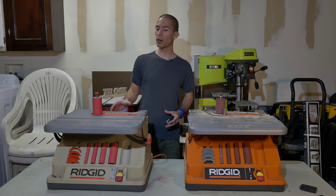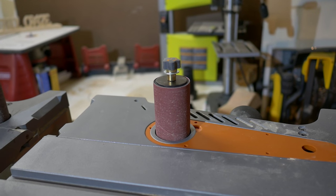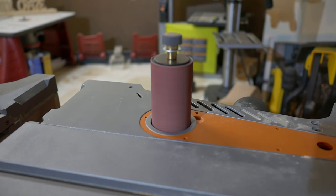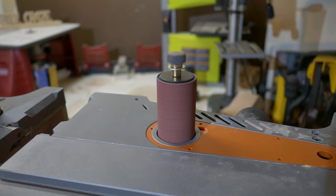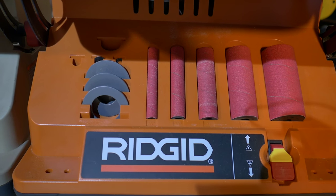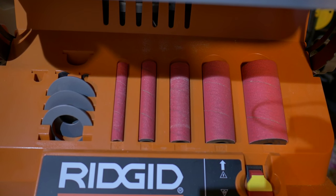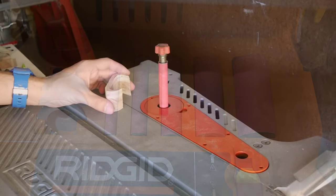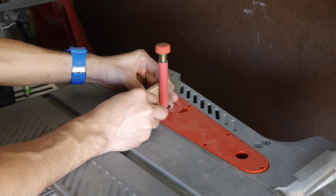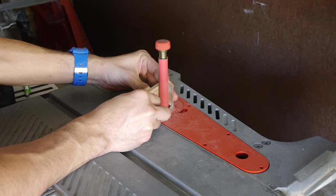One of the reasons I went with this particular model is because I was looking for an oscillating drum sander. What that is, is a sander that has a rotating drum and it moves up and down as it turns. The sanding drums are for sanding curves in your workpiece and can sand inside and outer curves. They come with several sized drums — five are included with this model, from a half inch drum all the way up to two inches, although it doesn't come with an extra three inch drum like the Harbor Freight sander does. The up and down oscillating movement is supposed to lessen the appearance of sanding lines, but in my experience you still get visible sanding lines when using 80 grit drums. You can always move up to higher grit to get a cleaner look.